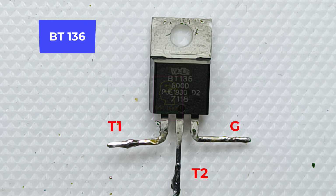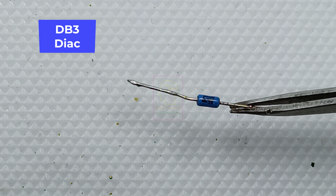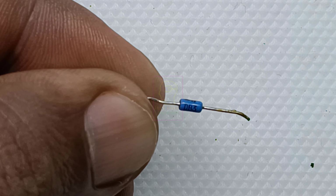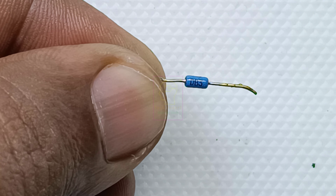This is BT136 Triac. And it can handle a maximum of 600 volt and can handle a current of maximum 4 ampere. This is DB3 Diac. Diac is an electronic component with no polarity. Earlier I have made a video on Diac and I will add the link in the description. You will get fair idea on Diac after watching that video.